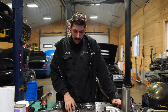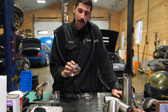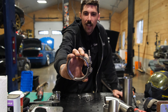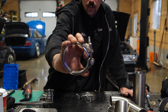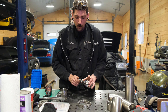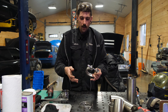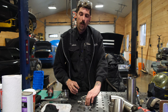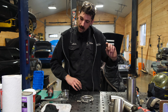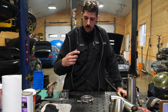Public service announcement: PSR turbos come with these really not-good clamps. If you look — one time use. You use it and it just takes all the thread off. That's why you need to get a proper clamp — Vibrant Performance, a few other companies also offer these. It's not a one time use clamp, you can clip it on and off. These cheap ones are trash — I literally did it up once and just chewed all the threads. So don't use those. Use good stuff.